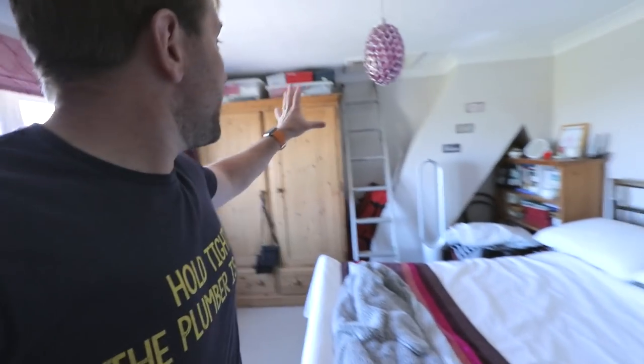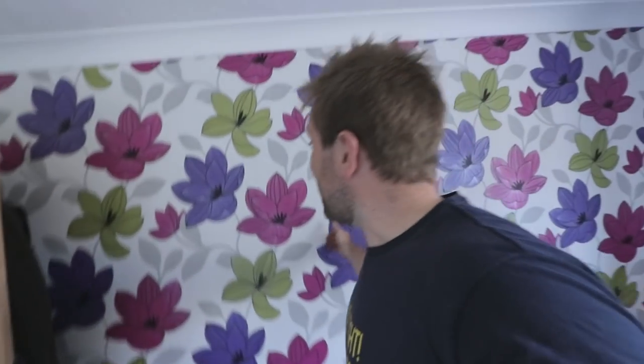There is another stopcock here, but it's under the kitchen plinth, right at the back, and it doesn't work. And to get to it, I would have to take everything out, cut everything out, and put something in. I am tempted to put a shore stopper in there, but I'll have to do that on another day. So today, what we have to do, because there's no pipes coming down that we can see, I don't know where they run. I think that it's probably in the wall somewhere, I don't know. But what we've got to do is tie up the ball valve in that loft tank.